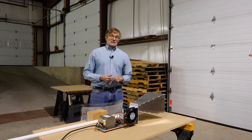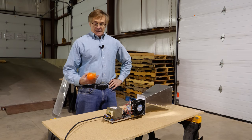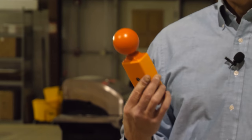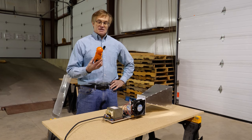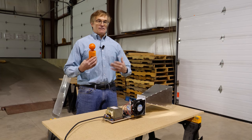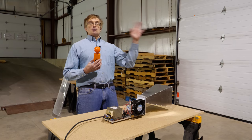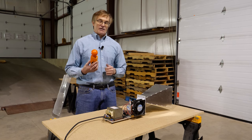If you want more sensitivity, there's a way to do that, though. And let me show you that now. Now, this is a field strength meter. It's used by radio technicians to determine polarity, as well as the energy, or the amount of intensity, you have in radio frequency emissions. It's really nice because it also gives you the amount of power being generated in millivolts or volts per meter. And this is a great method if you wanted to detect if you're even getting close to any kind of microwave energy. This would work from, you know, a mile away. It would be very effective.